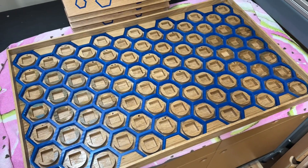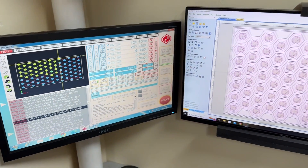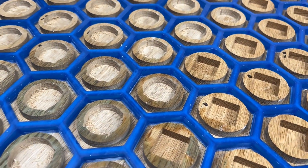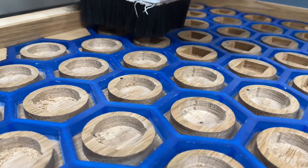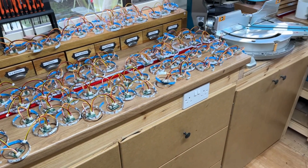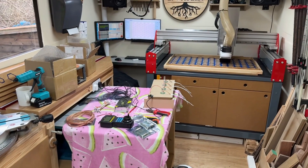Back to square one was wishful thinking. I soon realised that the new improved circuit boards were actually circular in shape, so I had to re-mill out the square recesses into a circle shape. It did however have the benefit of having an integrated proximity sensor. The old ones are on the side here and on my little test bench you'll see the new versions.